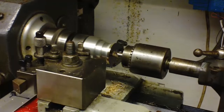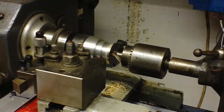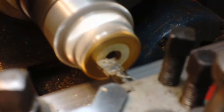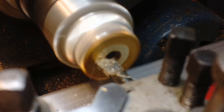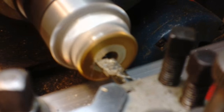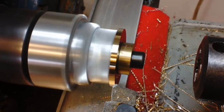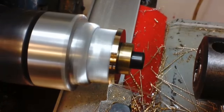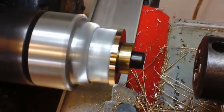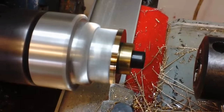The first step was to drill and then ream the centre bore and then I could turn down the recess. I actually went slightly out of order here — in retrospect I should have cut the recess for the collet at this point. Finally the wheel blank can be turned to the required outside diameter and then the whole chuck was removed and taken over to the milling machine for cutting the teeth.